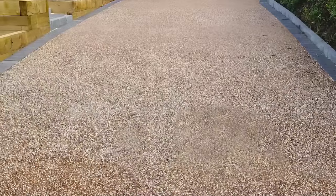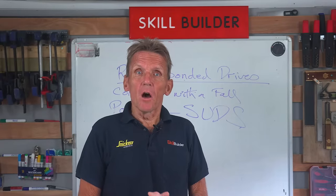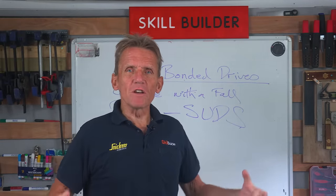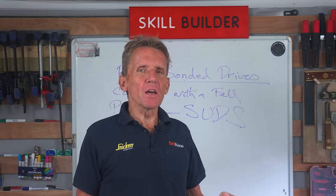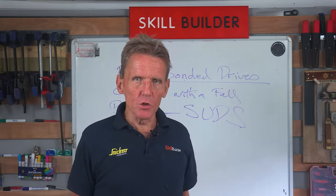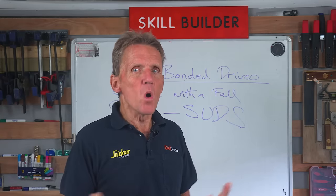So that aside, what else do you need to look out for with a resin bound drive? Is it a DIY job? Well, if you're going to use the resin bound material where it's all mixed up, then I would say not, because you need a special mixer to do it. You've got to clean that mixer out afterwards and you've got a limited working time.